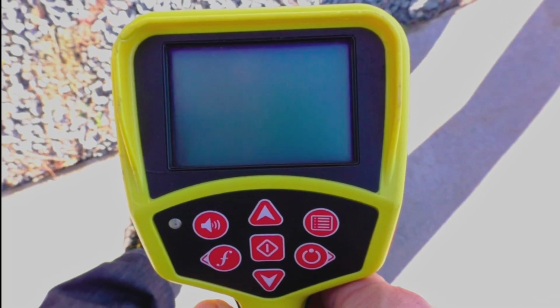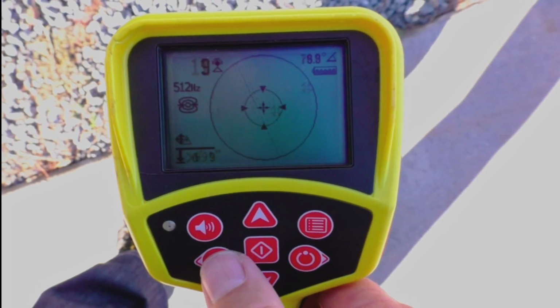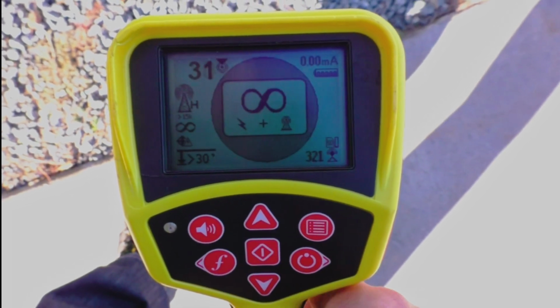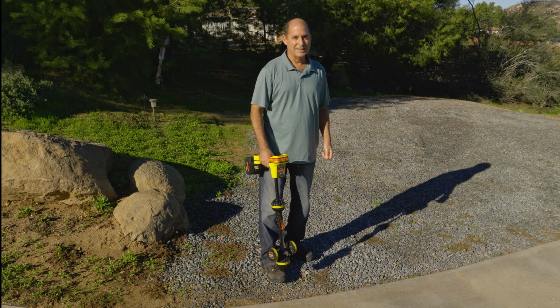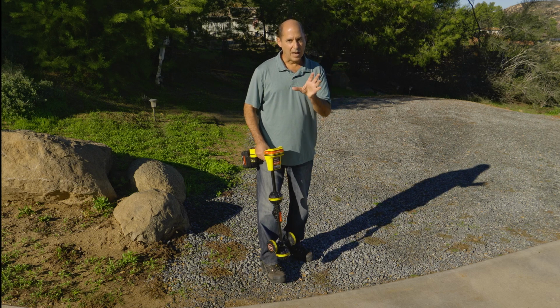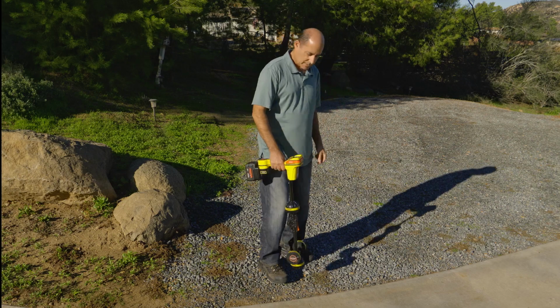We'll power up our receiver, then press and hold the frequency key and scroll up one click to the OmniSeek Passive locating mode. Or as my friend Marty at Burtech Pipeline calls it, binocular mode. SeekTech receivers have 3 passive locating ranges, and OmniSeek searches all 3 of them at the same time.